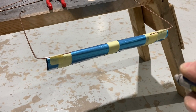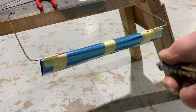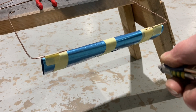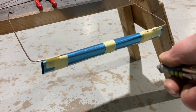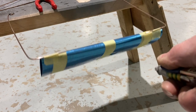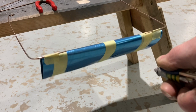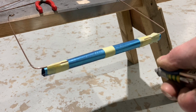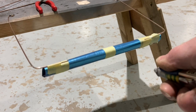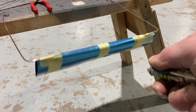Some people have noticed that when I did the fluttering control surface, the control surface is trailing edge heavy, at a pretty extreme angle of attack even though I'm pointing the blow gun down a little bit — and it's probably partly stalled with some buffeting. But when I slowed it down and watched it, I'm pretty confident that what we are seeing is flutter, not buffeting. It's regular, and if you slow it down you can see the control surface changing its pitch angle, which is affecting the hinge point, creating an unstable condition and an oscillation. That to me is flutter, but I welcome anyone's opinion who's more of an expert than I am. Thanks for watching, good night.